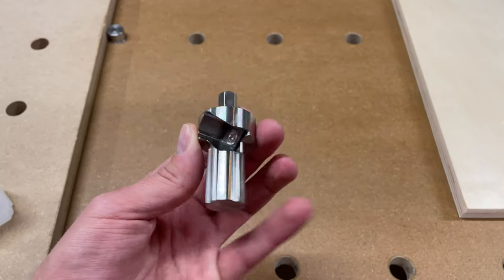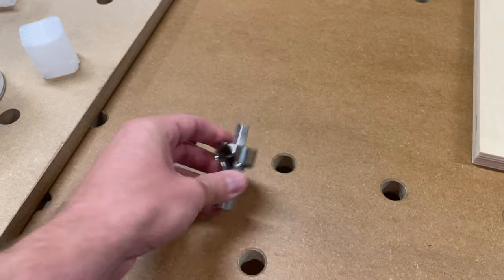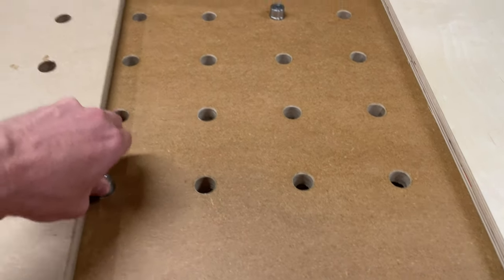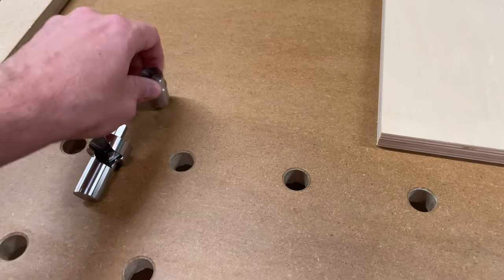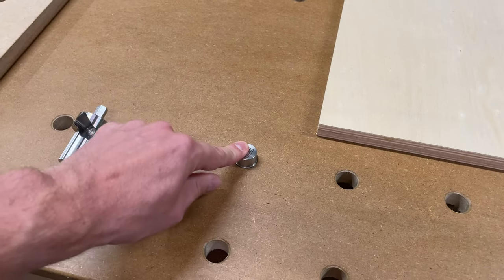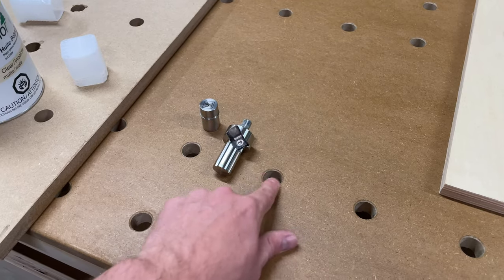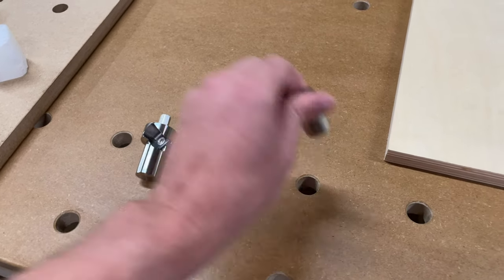Let me get it out so I can actually show you — I know I've covered this in some of the other update videos. This is the chamfer tool — the reamer and chamfer tool. This is what I used to originally put the chamfer on the top, but the reamer is what helps you if the holes kind of swell or contract and get a little tight when it comes to putting in the dogs. Right now they're going in with pretty nice ease, but not too easy, and there's no wiggle. But after finishing, they swelled up quite a bit — I had to jam them in and push from the bottom to get them out. So I used the reamer and re-drilled all the holes. I didn't redo the chamfer because I wanted to keep a bit of finish on there, and I didn't need to since the little lips on the dogs are still below the top.